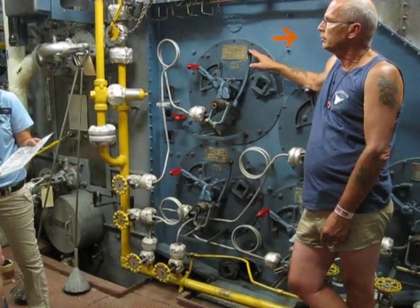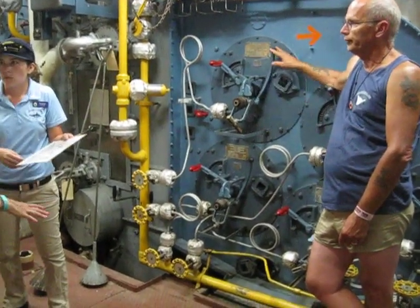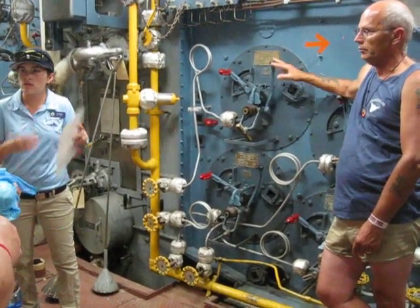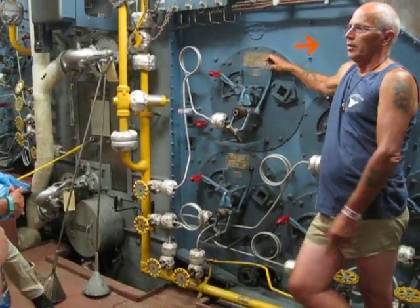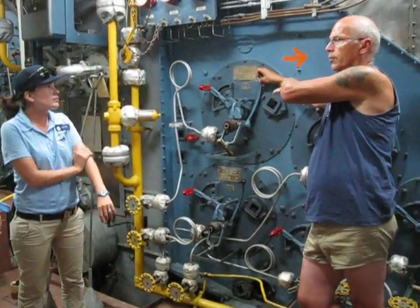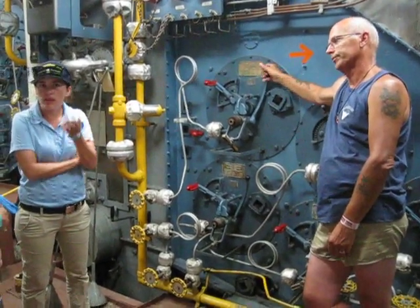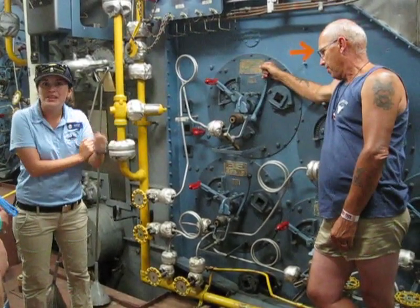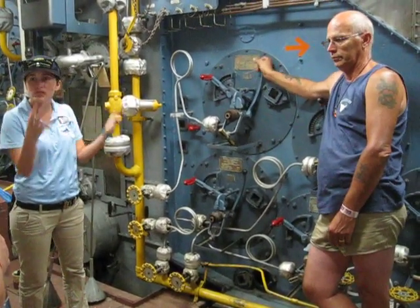What's happening with what is not pure — does it drop back into the water? No, but you still need some fresh water on board. From this process you're going to feed your boilers, and you're also going to have enough fresh water for showers, cooking, that kind of stuff. The main focus of your evaporators would provide water for the boilers; anything left would go for crew consumption. Because it is such a big ship with really good evaporators, they never had issues with having enough fresh water for regular daily needs.